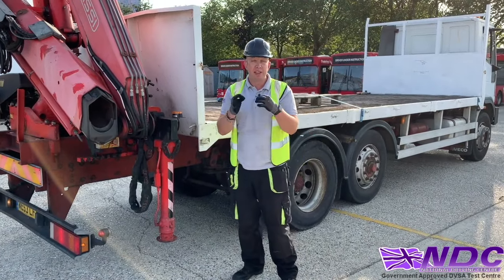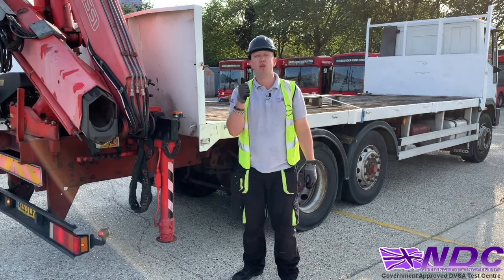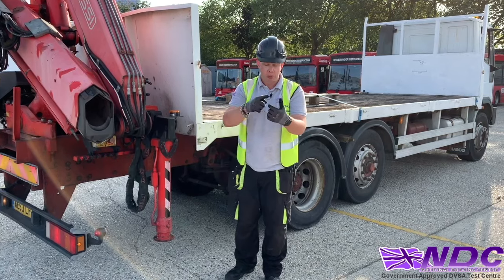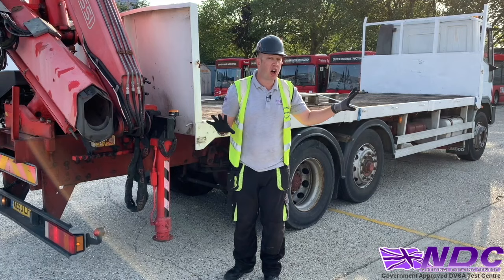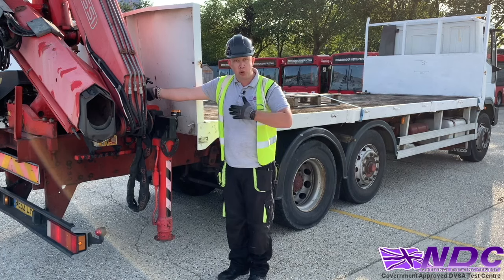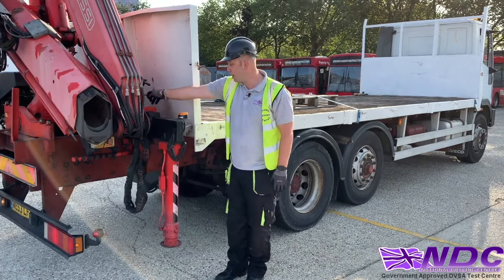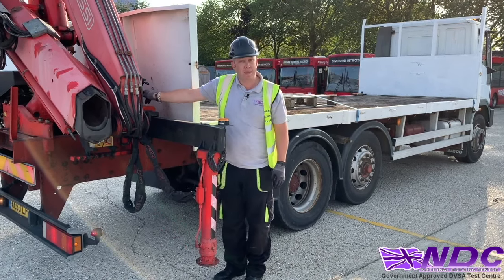The techniques and the tips we're learning here are the foundation for safety, which we will use all the time, okay? So a little look around, looking for people, animals, livestock, children, any vehicles or cars or motor vehicles around, and again just checking that the area is safe. I'm then going to grab the lever and pull towards me to bring the leg out to body length. So a little look around and bring it out. I'm then going to stop and have another look around just to have that double check.